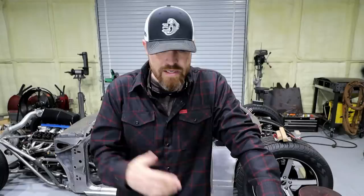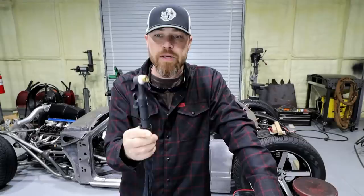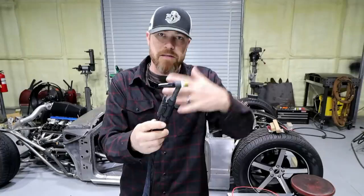The great thing is you can do both upgrades in one. You can go with a smaller torch head — the 9 or the 20, I believe, are the two sizes. One is basically air-cooled, the other is water-cooled. Depending on what setup you have, you can upgrade to one of those. It's going to be a smaller torch head, it's going to look something like this. This is a 9 here, this one is air-cooled. The 20 is water-cooled. Same exact body size, though. Makes it easier when working around stuff and holding things.